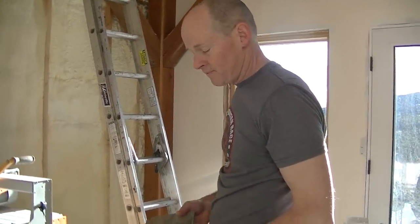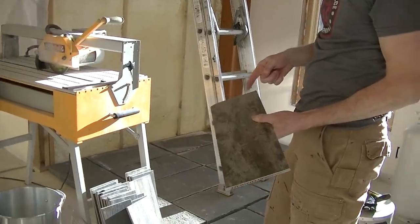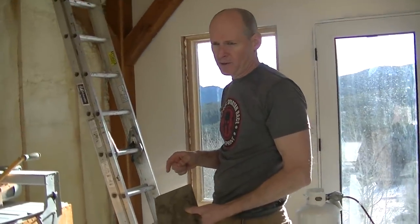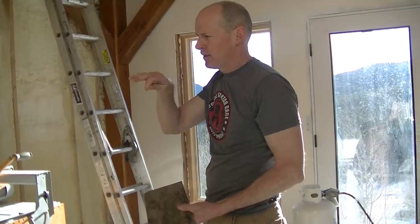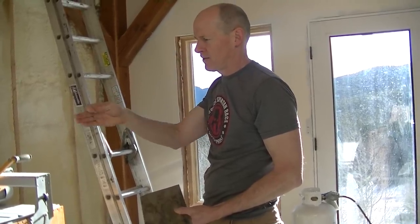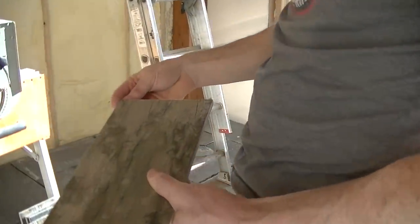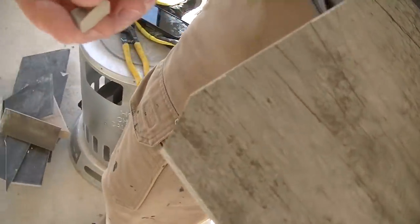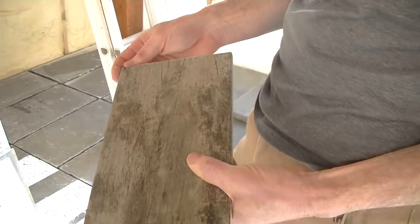So the first thing after your lines was getting your tiles cut. It's pretty even across — there's about 26 rows of tiles. We're doing a brick layer pattern like we did in the bathroom, so it's offset half a tile. I'll start with a full length tile first, then the next row will start with a half tile. What happened was I was cutting them and I could get almost all the way through and then the tile would actually crack — that was a pain in the butt.